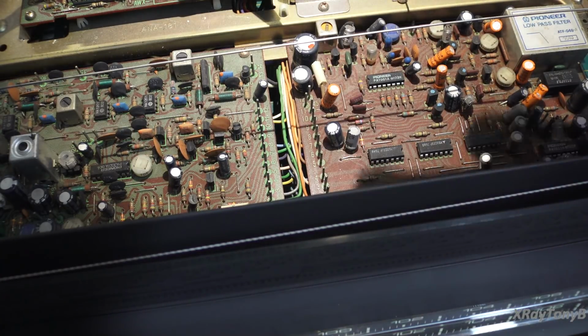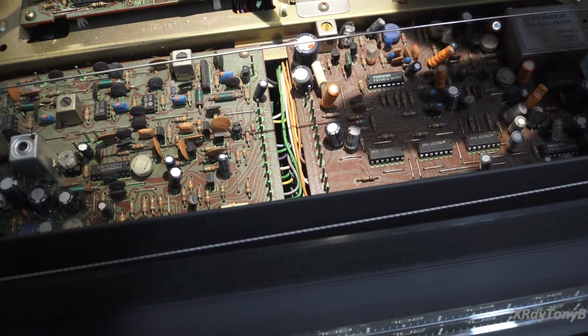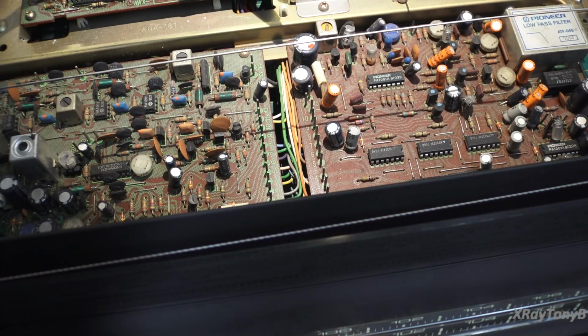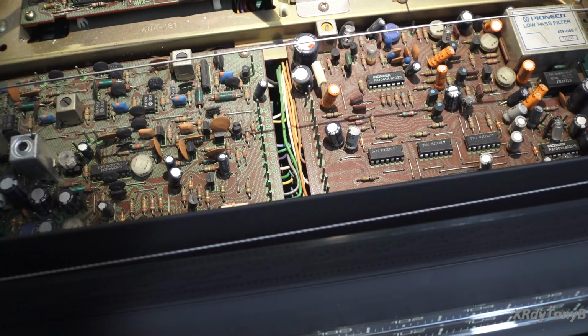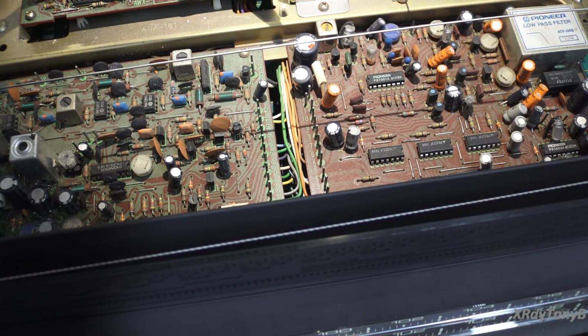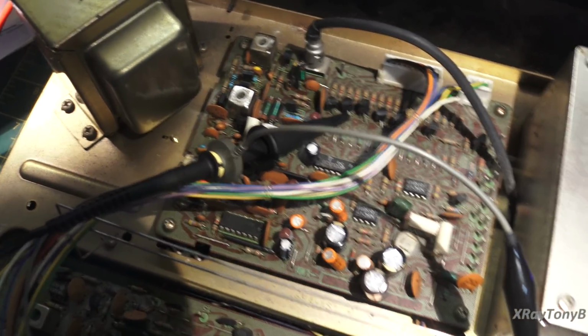A transistor checker is good to test if it's shorted or open. It's good to check the polarity, what leg is emitter, base, and collector. It can give you the static gain of the transistor, different little things like that, but it's not going to give you the performance. It's not going to show it under use. And so that doesn't guarantee, just because it checks good, that it is good. And case in point was this one here. That's the problem that I'm running into.